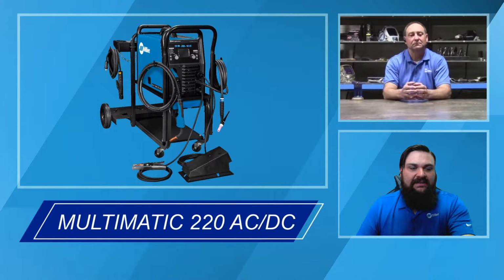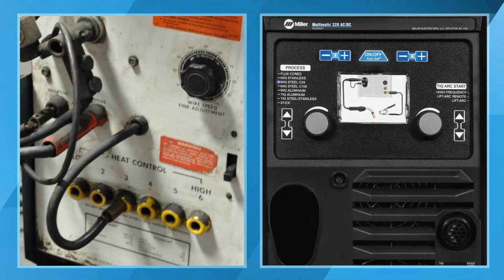So one of the things we had talked about is a lot of the simplicity that we can gain from these style machines. Chris has talked a lot about AutoSet, and we can pull up a bigger picture of that in a second. But one of the things we want to stress is if you look at the front panel of the old Millermatic 35 versus these newer style machines, you see all the yellow jack plugs on the front of that machine. That's how we were physically tapping into a different spot within the internals of that machine. So you had a lot of variables there. You can see a lot of the parts were actually external for the different wiring and things like that, where with the faceplate and the AutoSet technology built into a lot of the newer inverter style machines, or even in the more advanced machines, the different user interfaces are so much more convenient to use and less complicated than they were on a lot of the older machines, especially if you didn't know exactly what those functions meant.